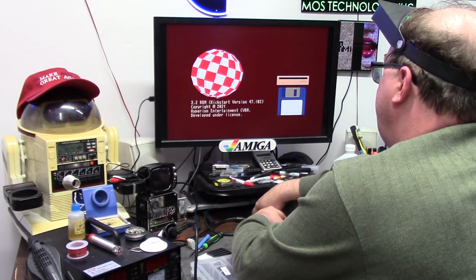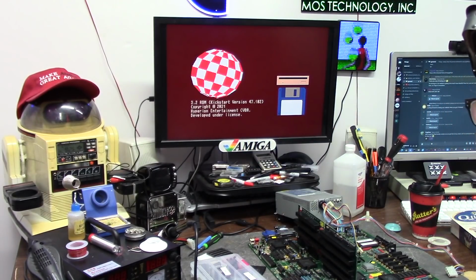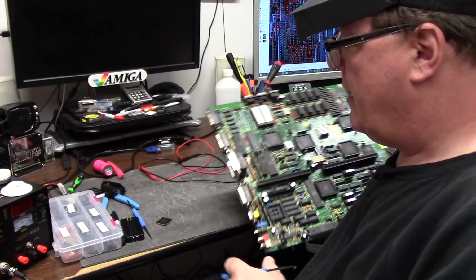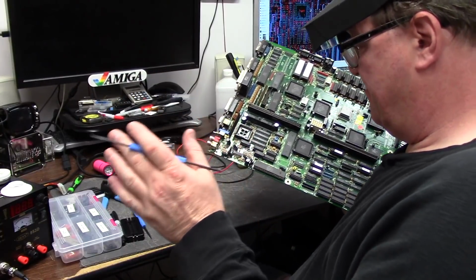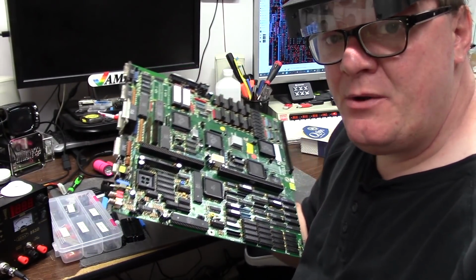Crystal clear on RGB, which is the Amiga's native video. Crystal clear, 31 kilohertz or 15 kilohertz. 31 is only red. I have removed the amber chip, so I pinned out amber. Pinned it out. All the continuity matches. 4 buffer chips, 3 Oki datas.